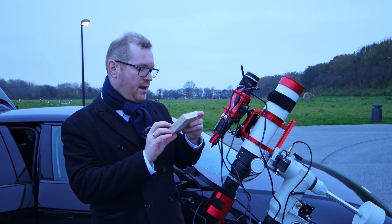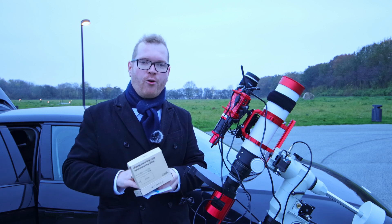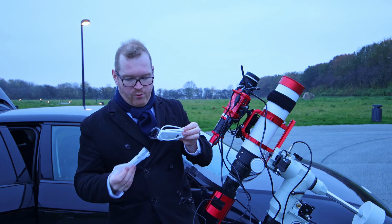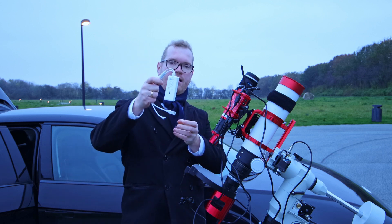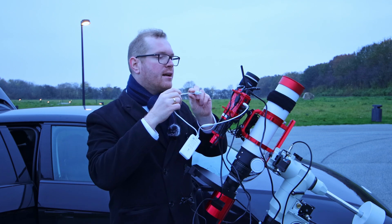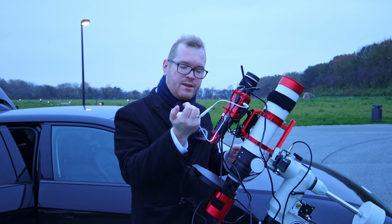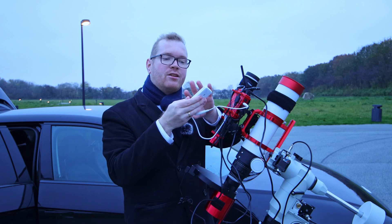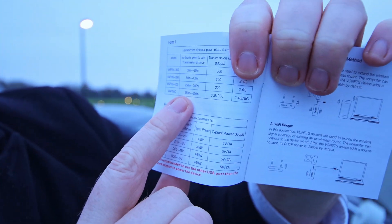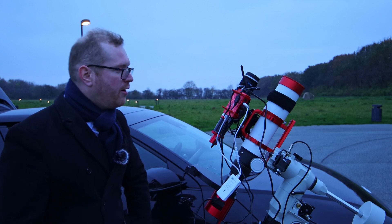The next one here is a device from Bonnet — it's a high performance Wi-Fi repeater slash bridge. I don't think it's necessarily purpose-built for the ASI AIR, but it is excellent for it. It's just a small little box. It has a barrel jack that we connect in here on the side of the ASI AIR, and then it has an ethernet jack that we connect into it on the ethernet jack, like so. Now if I go in and turn on the power for this thing, this should open up its own Wi-Fi and we can then try to connect to this. It claims right here in the manual that it can get up to 250 to 300 meters of range. Now we're going to put that to the test.